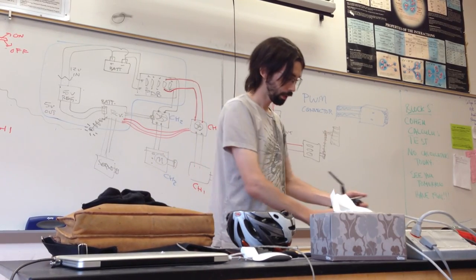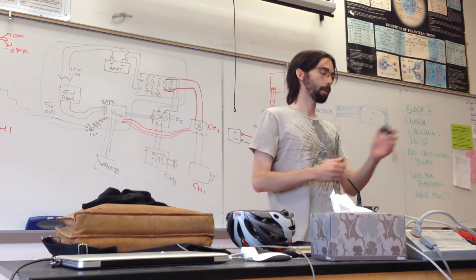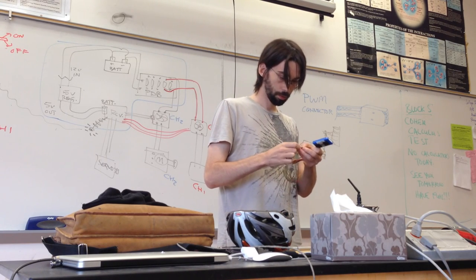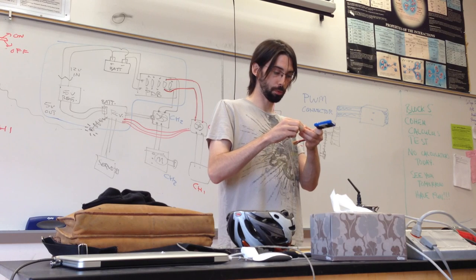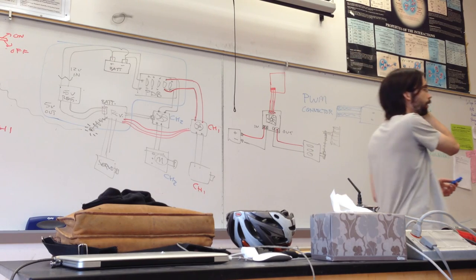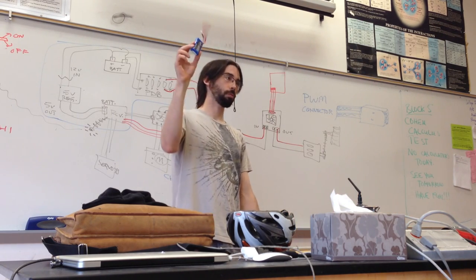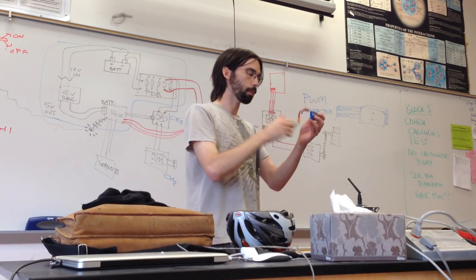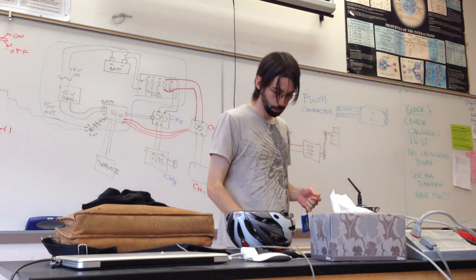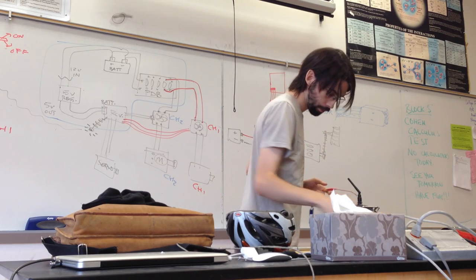One final thing: I have enough stuff here to make a simple setup with the servo. I've got my receiver, this is my battery. This is a 12-to-5 volt regulator. This is a real small battery — it's actually a 7 volt battery, but pretend it's a 12 volt; the regulator will still operate. I'm going to connect from the positive and the negative. My multimeter shows we're getting about 8.3 volts — so it's a fully charged battery of this kind.